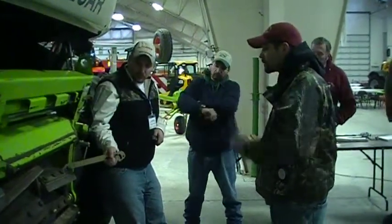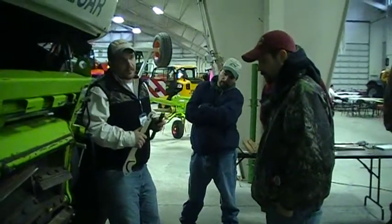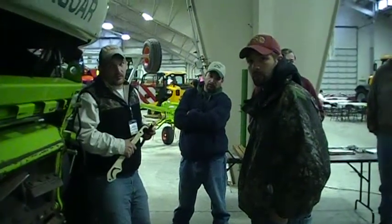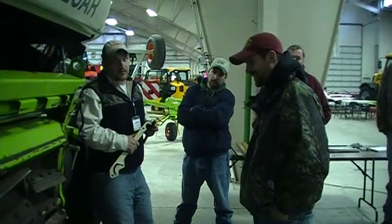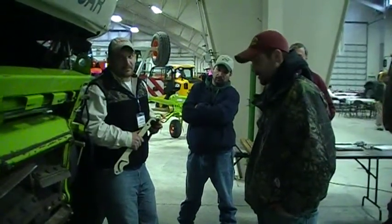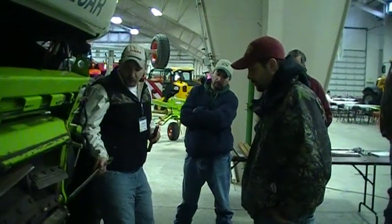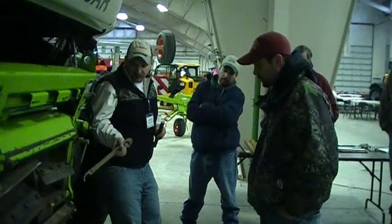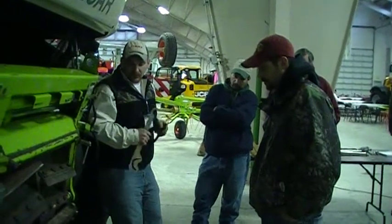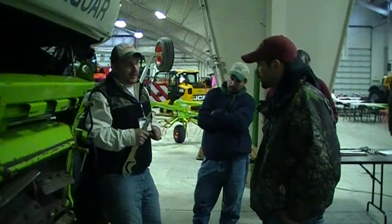Those ones go to, I marked it on there, 232. It's very critical that those get torqued with a torque wrench in a proper sequence and not, I know what my rattle gun does. If that lets go, it's 30 grand. So, pretty crucial. There are new bolts that come with the shear bar too. You're going to use new bolts on that as well. The shear bar goes to 143. Same thing, good torque wrench, you want to actually know what they're at, not kind of.